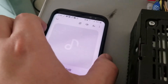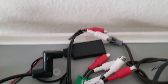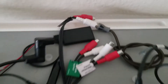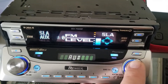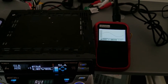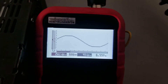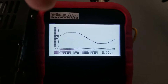With my phone volume all the way up, I'm seeing 5.32 volts on the white subwoofer output. Going into source level adjustment and turning that one click up, I see six and a half volts — and it is definitely a soft clip at six and a half. All those pixels in a straight line is a definite clip.